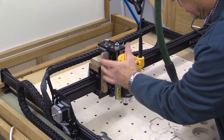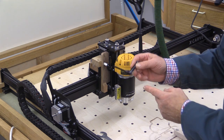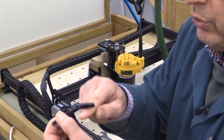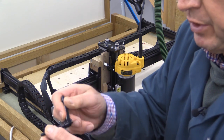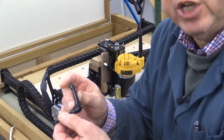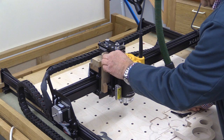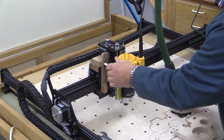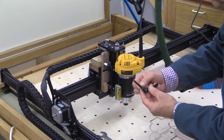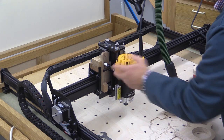I'd just like to show you how I'm holding these slides in place. I've used what they call a Bristol lever — some people call it a Bristol knob, but it's a Bristol lever. It's got a handle or lever here and a thread attached here. To save it having to be rotated completely, it's got a built-in ratchet mechanism: you pull the lever back, move it over, let it go back down into the ratchet position, and so on — you never need to rotate it through 360 degrees. I've had to use spacers here, not because of the lever's thread length, but because I wanted to bring the whole thing out far enough so it doesn't get mixed up in any way with the mechanism of the motor going up and down.